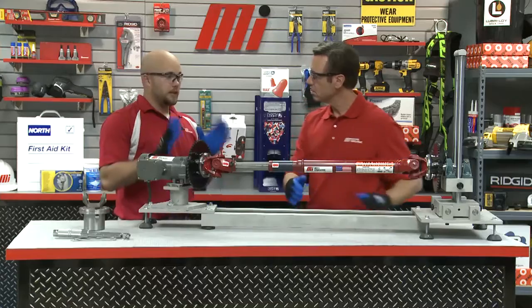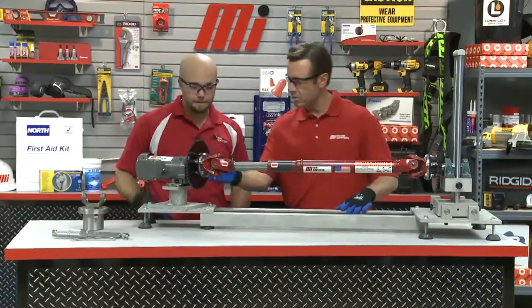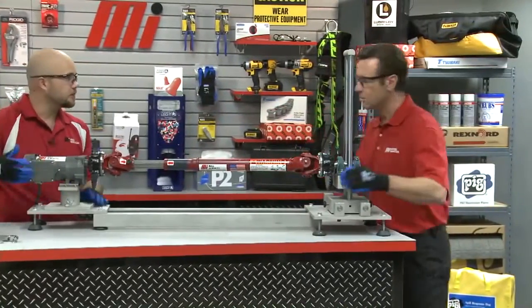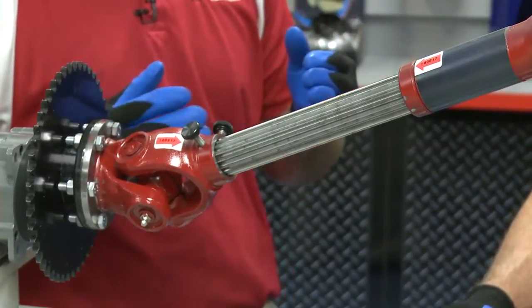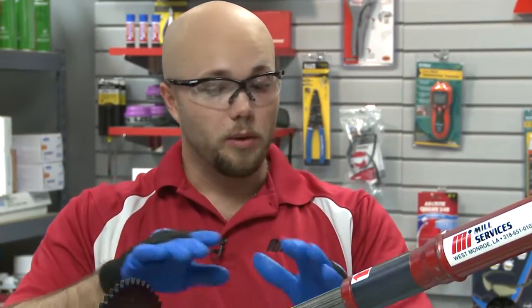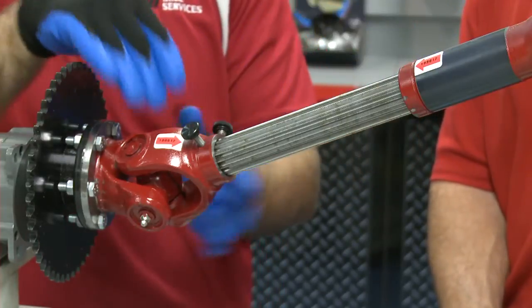What's next after we got that taken care of? Well, the next two critical things have to do with when you're actually mounting this — the setup and configuration you use when installing this drive shaft. When you install this drive shaft, you have to be aware that the actual yokes on this drive shaft assembly must be aligned, usually within one to two degrees, in order for this drive shaft to operate properly. Mill Services provides phasing or alignment stickers on the drive shafts so that if while you're installing or doing any maintenance the slip comes out of the drive shaft assembly, you will know where to put it back together to ensure you have the yokes phased correctly.